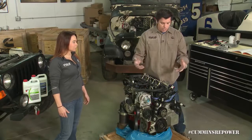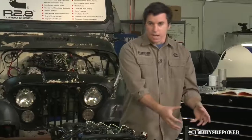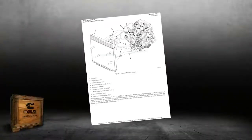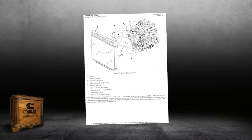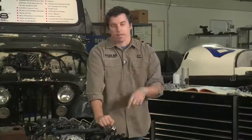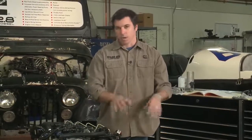It's really good to verify that you have coolant all the way up to that point. That port is also part of a fully deaerating coolant system. We recommend running a line from here and from the rubber cap on your thermostat housing, teeing those two together into the top of your tank. On the bottom of your tank, tee into your lower radiator hose. On your radiator cap, also route back into that tank. This helps purge all the air out of the system and prevents damage to the engine or radiator.